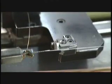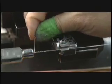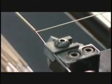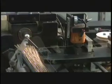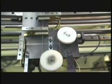Finally, strings are ready to be wound using Daddario's exclusive computer-controlled machines. A worker fits the ball end of the core wire onto the machine and starts the wrap wire feed. The electrically powered winder spins the core, grabbing the wrap wire, which is then drawn down the length of the core. The winding carriage ensures a clean and consistent wrap, while computerized sensors monitor the winding speed, tension, and wrap angle to ensure specifications are adhered to during the entire process.